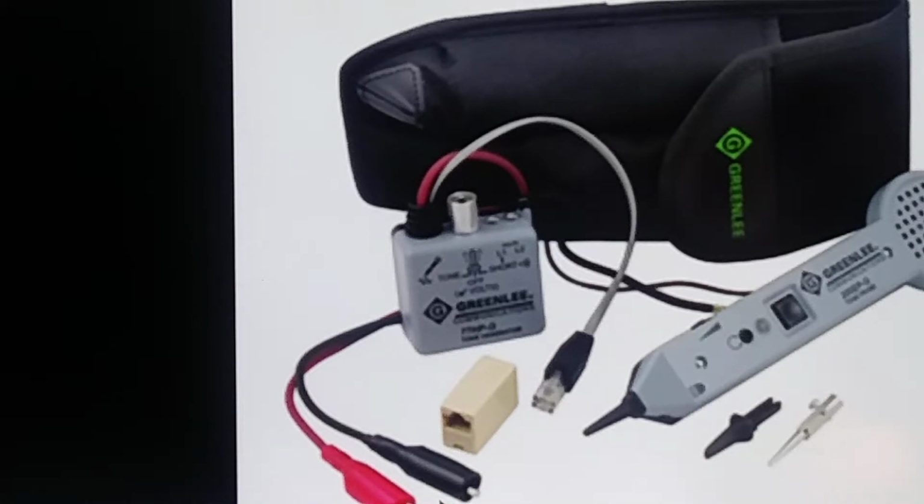You can use this to your favor when it comes down to chasing wires. What you do is you take this guy here and clip him to a piece of conduit, or clip him to a ceiling grid, clip him to something in the building that is grounded, that is a negative source, if you will. Now, this black lead is as big as the building. If you take this red wire and you clip it to your wire, whatever you're looking for on the other end is suddenly amplified seriously, because one side of it is the building instead of the other wire.